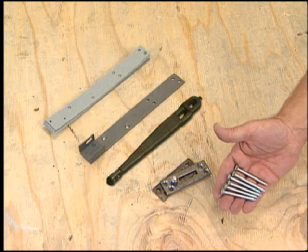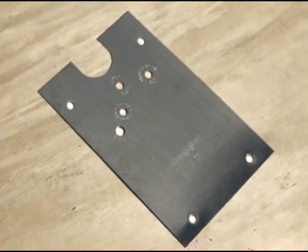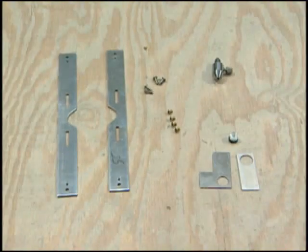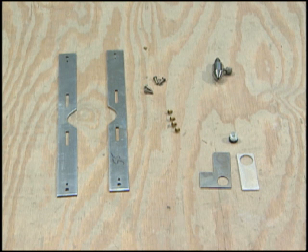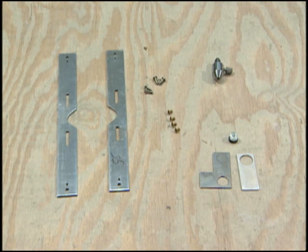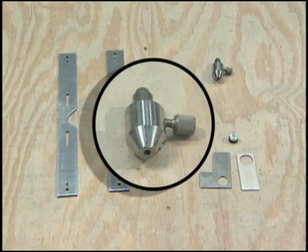Rixson pivots and floor closers are shipped with both wood and machine screws — determine that you have the right screws before starting. Also included: a wood door bottom arm package, and for doors without thresholds, a finished cover plate. No tool box is complete without a Rixson 185 quick spotter kit, which includes metal straps for positioning the closer in the cavity, screws for attaching the straps to the closer body, a spindle locator to properly position the closer, and a bubble level. To ensure accurate alignment of the closer and the top pivot, use a Model 2604 pivot alignment tool.